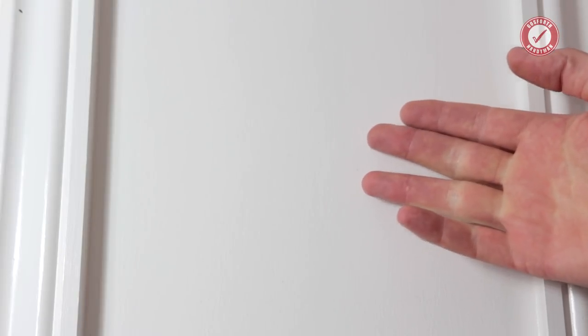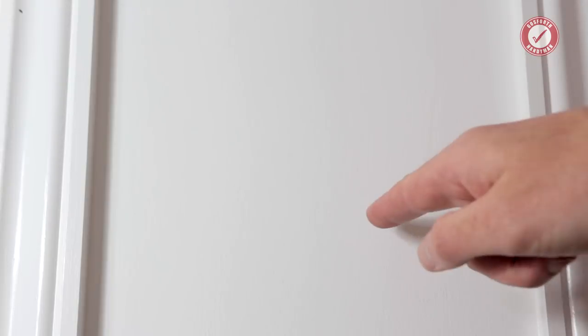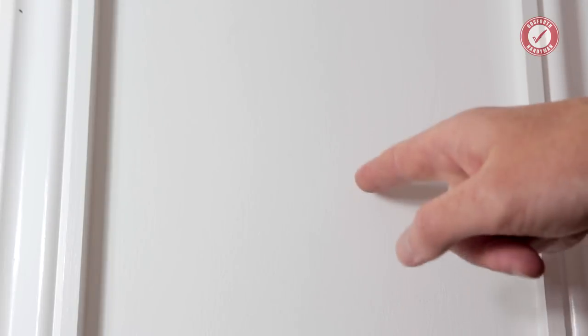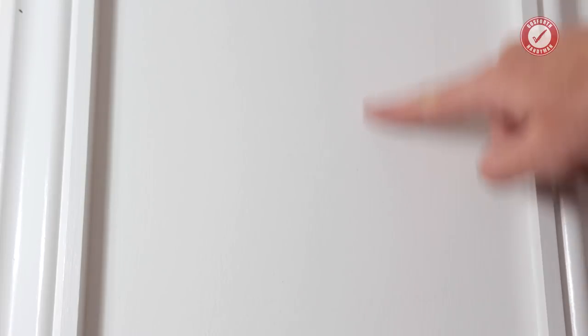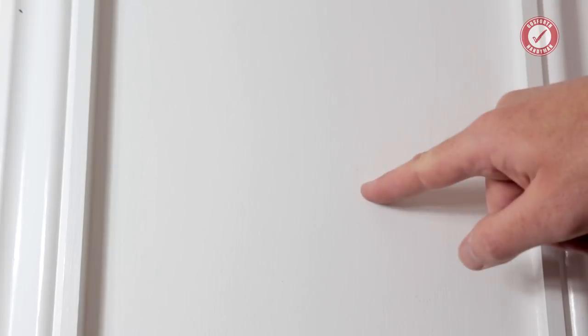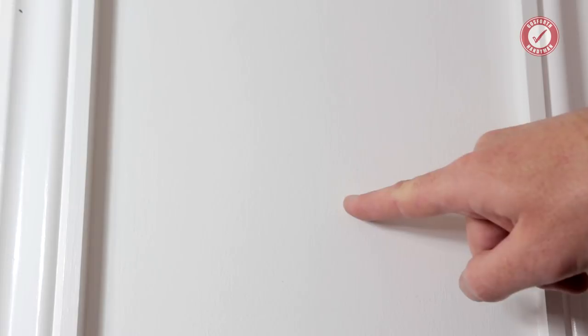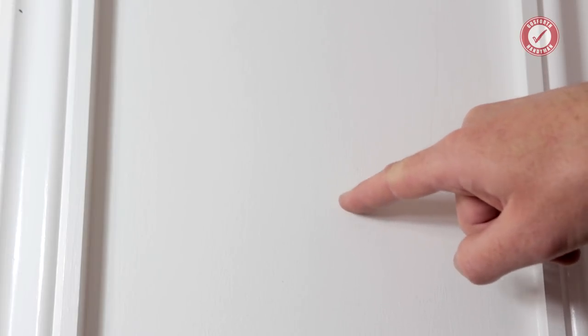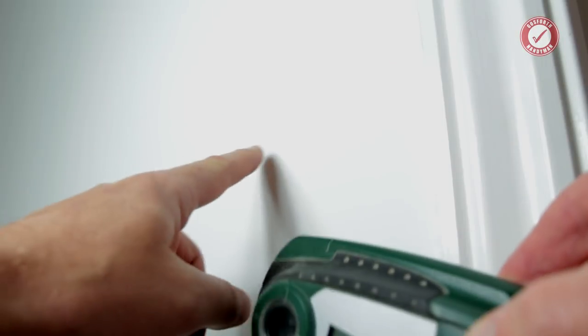But what I would now do is use a blunt masonry bit to drill my hole, and I would be very, very careful that I'm not actually going in, because it could be a pipe running up here. I don't know, but it's more likely to be the metal stud of the wall that's on the other side of this. So I'll tentatively go in with a blunt masonry bit, and then I should be able to tell what's behind the plasterboard. We'll look at a different wall now.